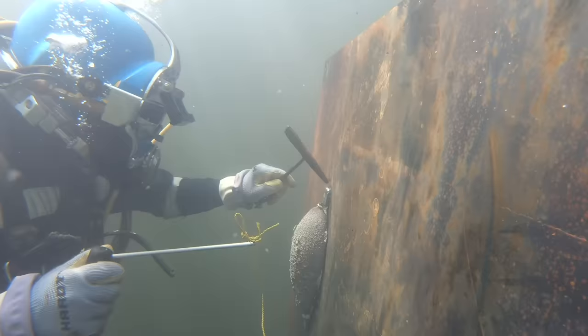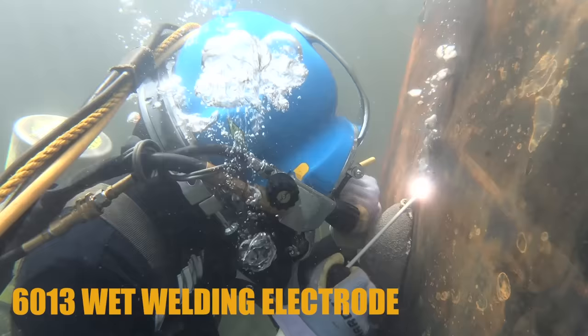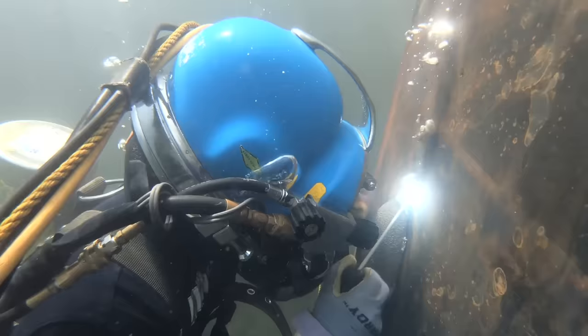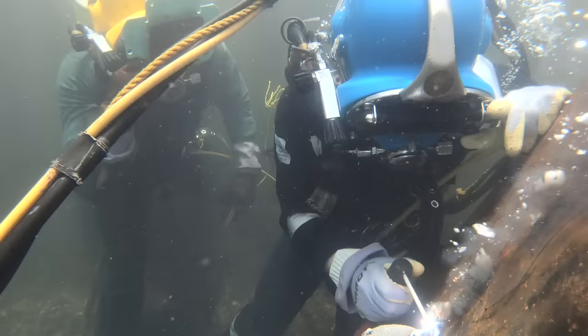There's more than one of the clips on the anodes, so if I was to reweld these anodes I wouldn't go uphill - I would just go downhill. The stick electrode I was using was a 6013, and it was coated with a special coating that kept it dry. Like I said, the hardest thing about welding underwater is visibility - those bubbles coming out of the weld or puddle get in your way and make it extremely hard to see where you're going.